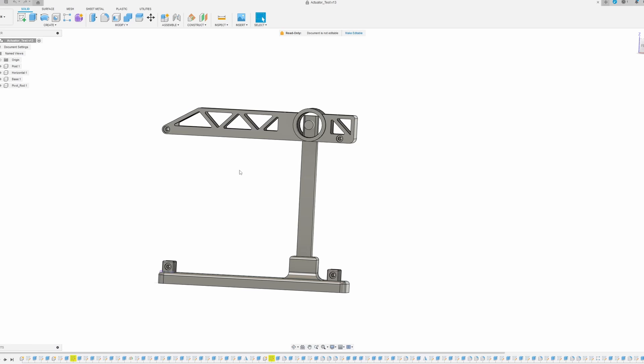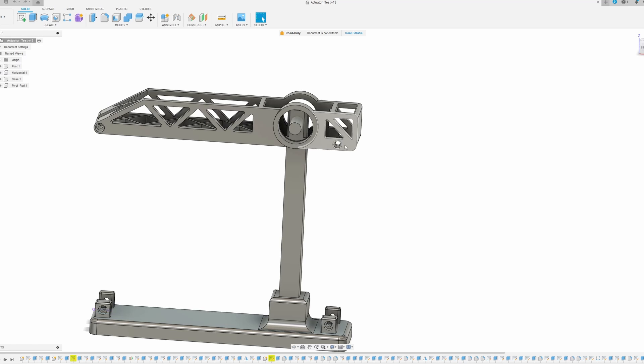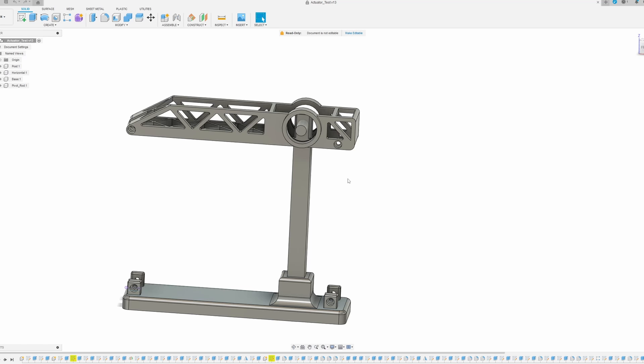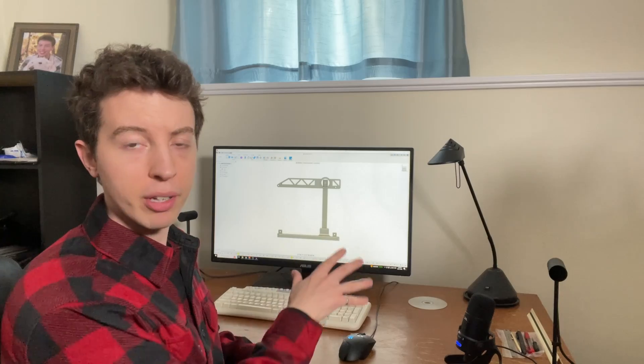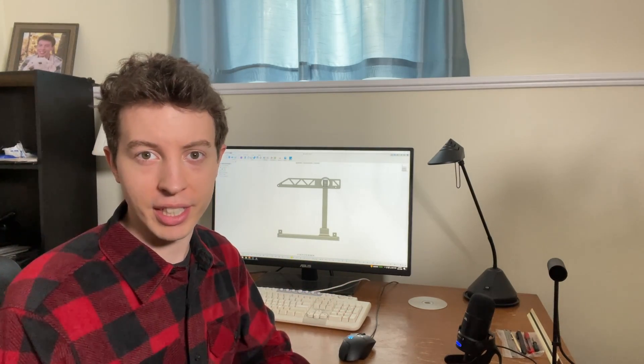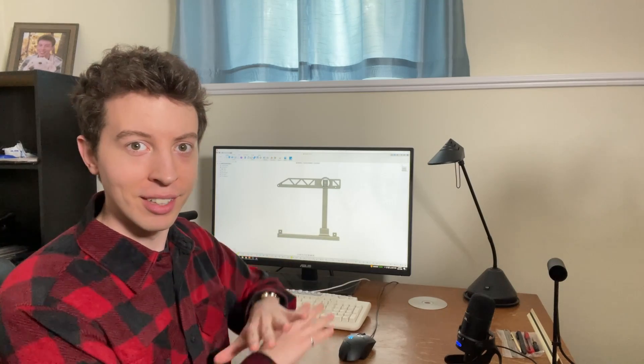This is the simple design I came up with for us to test it on. So we have this crane-like assembly — we'll have our load connected to the front here, we'll have the whole thing running on a set of skateboard bearings. This back section is where we'll run the Nitinol wire from a bolt that passes through these holes all the way down to the base. This should work as a pretty good test bed to get the mechanics of this Nitinol wire down. So we got our CAD model done and it's time to go full computer-aided manufacturing on this and get it done as quick as possible so we can move on to the real testing.